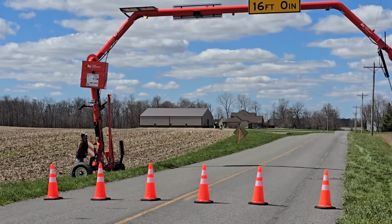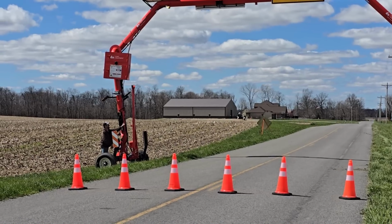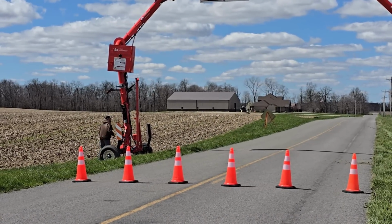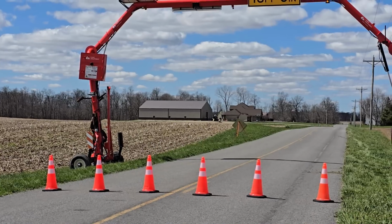You don't want to send manure through that high up in the air, 20 foot, without the unit perfectly level, just to keep everything balanced. So right there, my tilt indicator says it's straight up and down. Now I'm going to check my height indicator.